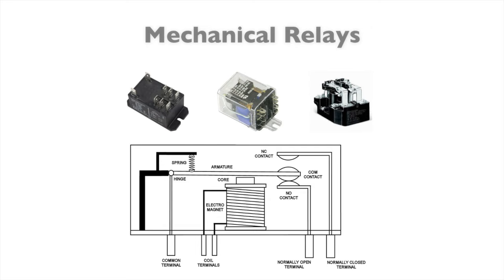But it looks pretty much the same. We've got what replaces what. We have the relay and the computer have replaced the switch. The thermocouple and computer in conjunction have replaced the kiln sitter. We've got a little thing in there called a transformer.